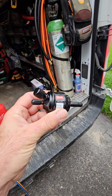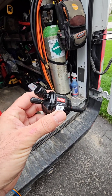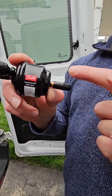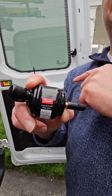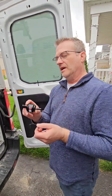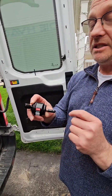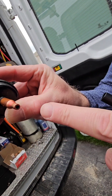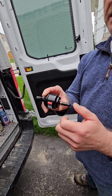I've replaced dryers twice, and I know people who have replaced dryers twice because they plug, get replaced, and plug again instantly. If you don't understand dryer nomenclature, sizes generally go three, five, eight, sixteen — eight and sixteen are the ones you'll see mostly in larger refrigeration and residential AC systems. Once you get into smaller refrigeration, especially with a cap tube, the sizing changes.